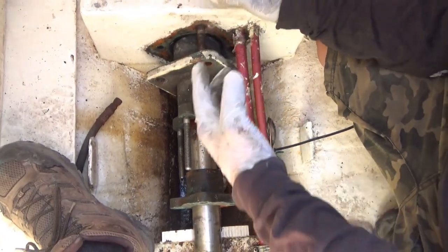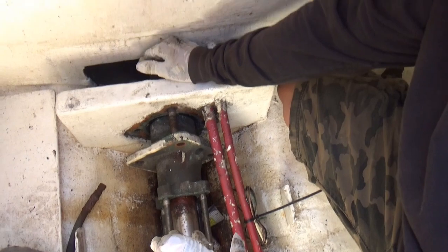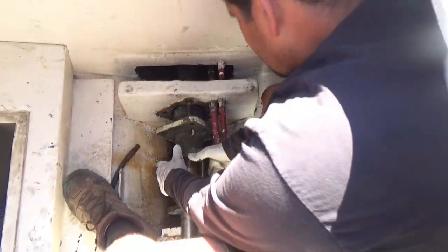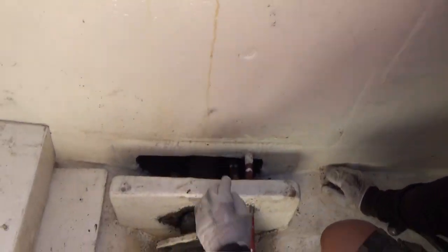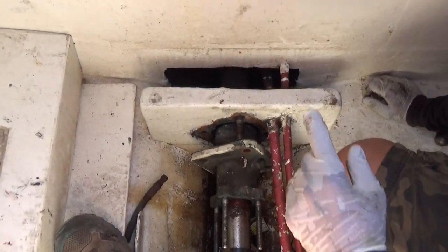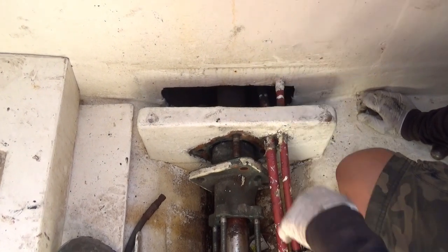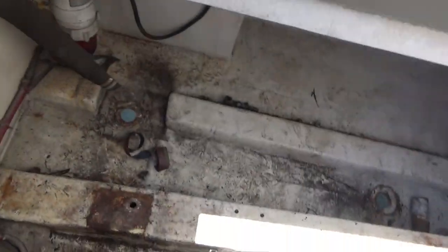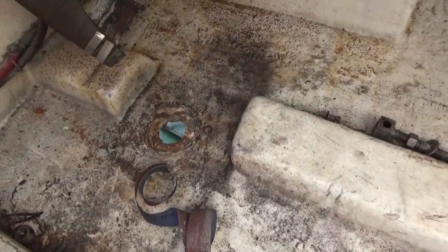What's that weird gap right there? This is just a brace for holding the packing gland, because this is a keel — it has a long keel and a long pipe, about 10 feet long. It's a stainless pipe on this side that hooks up to the back of the bearing box. We also got the keel cooler off — he's been cutting out all the penetrations here.